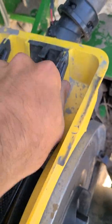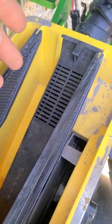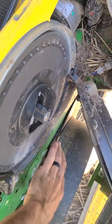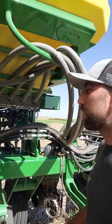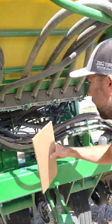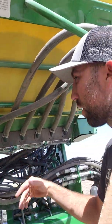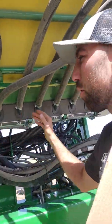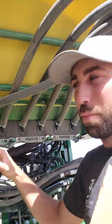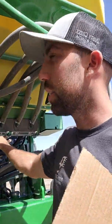Make sure the card is back in place and there's no other debris — corn seeds or soybean seeds — in this area. Push any remaining seed back down into your catch. The last thing to do before turning your fan off is come under the CCS hoppers and open these trap doors. While the air is blowing in there, empty those out and clean them one more time — that air circulating through should blow everything around. Open all your trap doors, scoop everything out, and make sure all seeds are clear from your CCS hoppers.